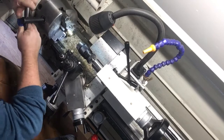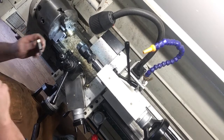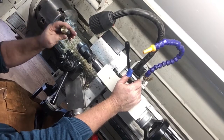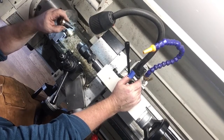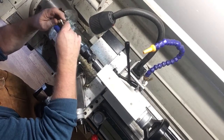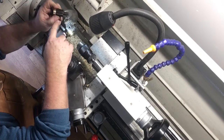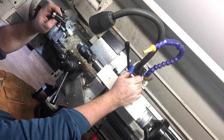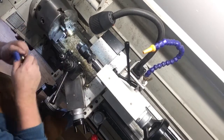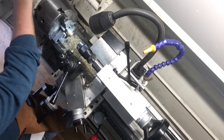Although I have a fairly large lathe for an instrument repair shop, you can actually do this on a little 7 by 14 mini lathe. This is essentially a live center that I made — it's a piece of steel I turned and counter-bored, and there are two skateboard bearings in it. It's pretty low-tech, and then it has a brass end that I also turned.